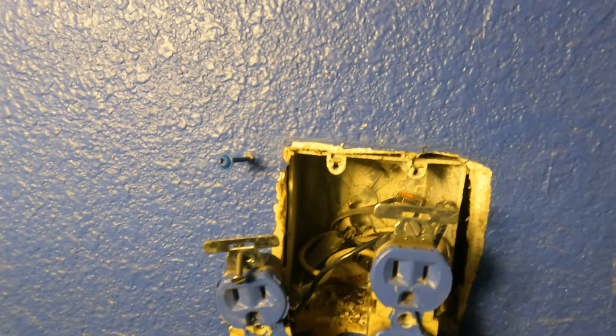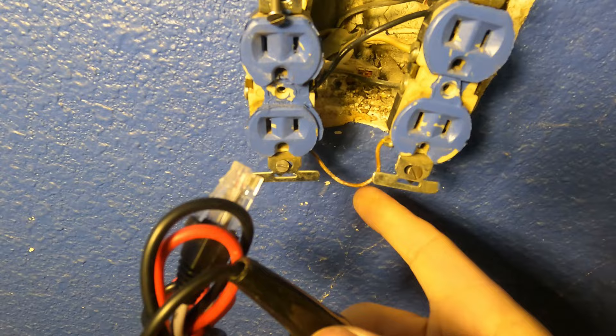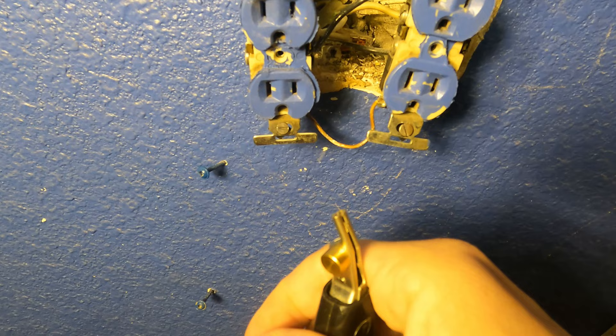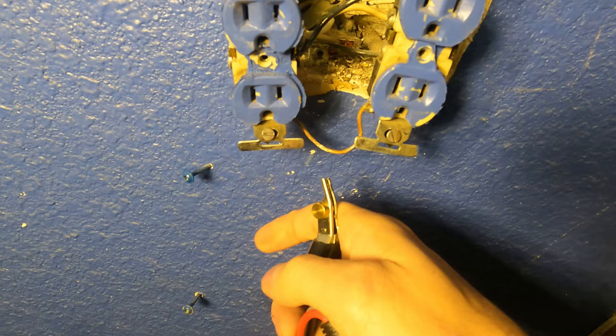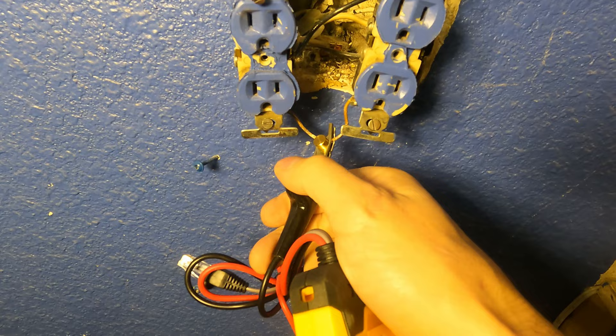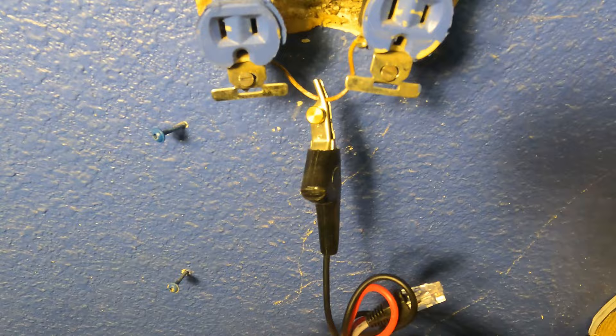Perhaps one of the most important things when hooking up one of these tracers is to make sure you have a fully established ground. If you don't have a good ground, get an extension cord and rig something up to attach to a known good, clean ground source. In newer construction, grounds might not be hooked up, so tracing can be tricky. I've used a customer's oven hinge before when tracing a light switch in the kitchen, since I knew it was grounded — that's just another tip.